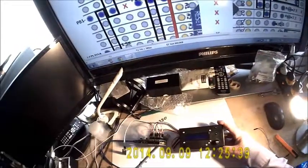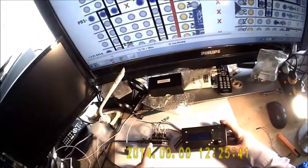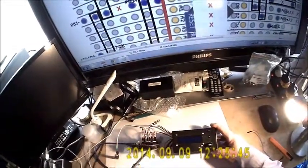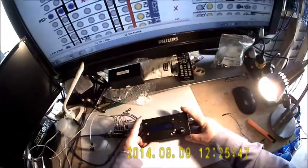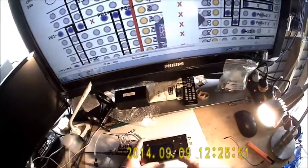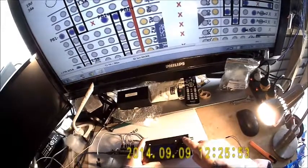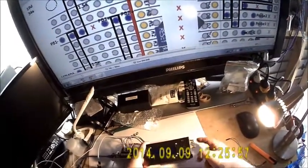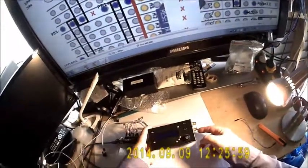This is going to be my G-controller project. I'm just using a Uno at present, but it's going to be a Nano on a board. I have wired here an LCD display 16x2, and some LEDs which will be PWM driven associated with each of these two outputs here.